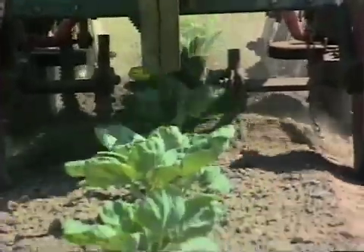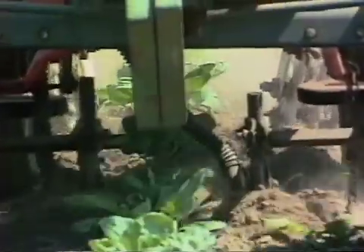So you're going to move these in or out so they do just what you want to do. Speed is important. The Lilliston likes to go fast — that's the cultivator in the rear. And if you can go fast and not hit the plants with these, it'll work even better because you can throw the dirt in there.